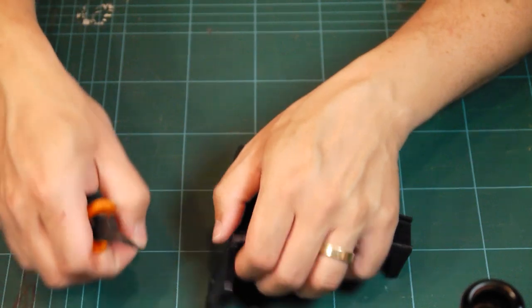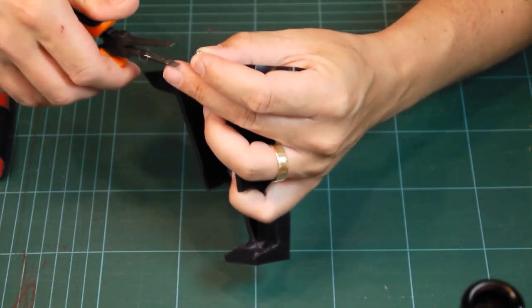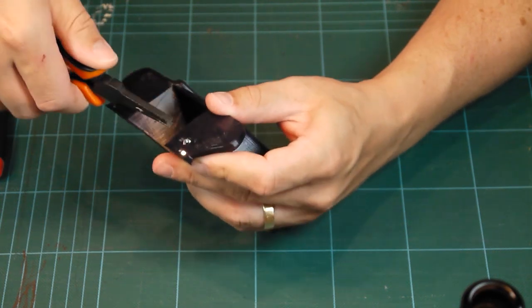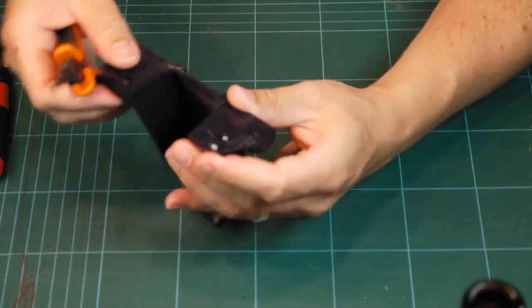I had a tiny amount of warping on some geometries, and I bumped up the bed temperature from the recommended 40 degrees to about 80 degrees to deal with that. To sum things up, PCTPE is a bit of an odd material but really, really cool. It's ridiculously strong and flexible, but still not very hard to print.